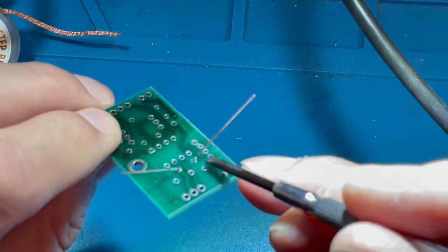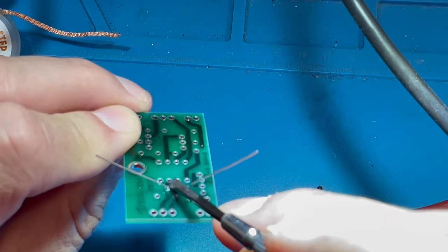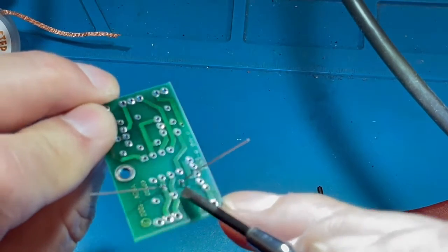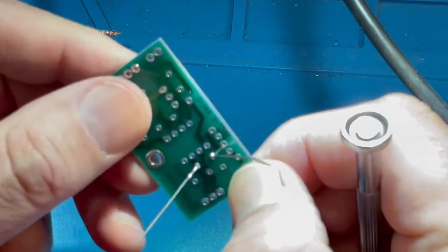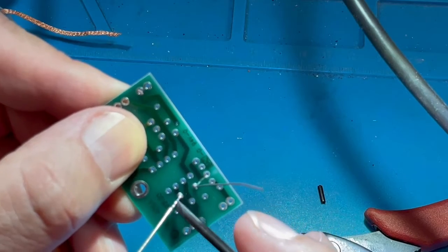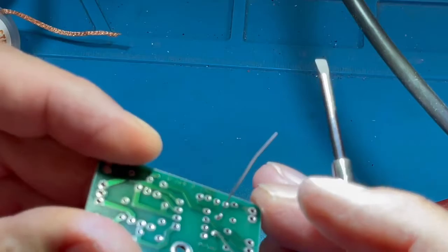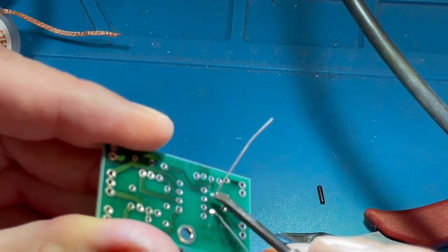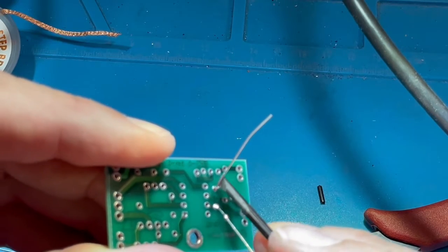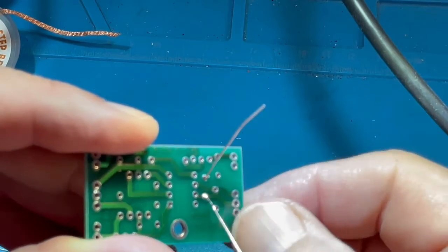to illustrate. You see the solder is flowed over the junction in a nice smooth shiny silver type of flow between the actual pads and the component. That's a sign of a good solder joint. The other side just has some extra solder, and that's okay. I can leave that there. But that too has a nice even flow all around the pad up to the component that's protruding from it.